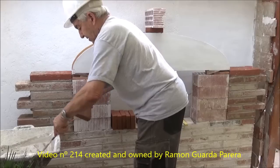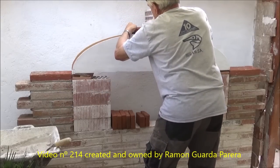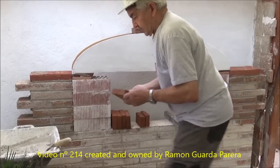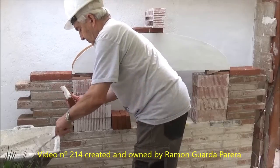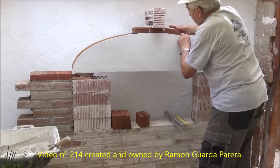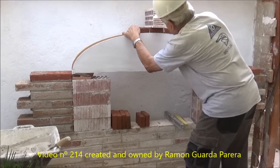Once everything is prepared, we cement the side of the brick and put it on, holding the one that is already in place so that it does not move. The reference piece allows us to continue. We try to choose bricks that are not damaged. We are placing the bricks one on each side to go forming the arch. Any way, you can make the arch perfectly by working on both sides or on a single one. The template is perfectly vertical, which allows us to use its edge as a guide to align the bricks correctly.